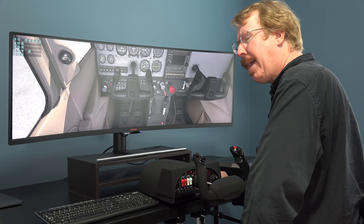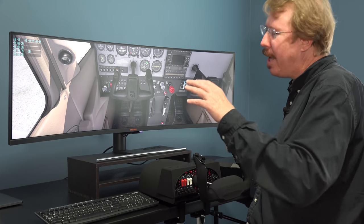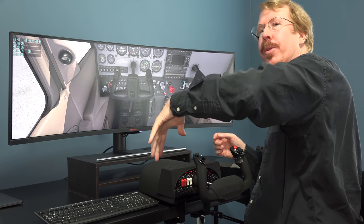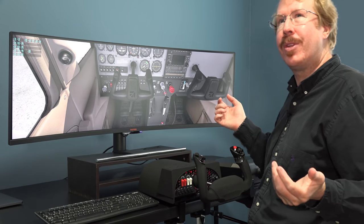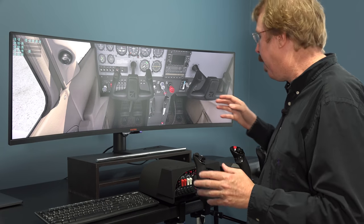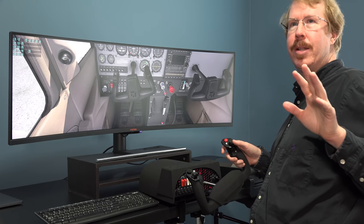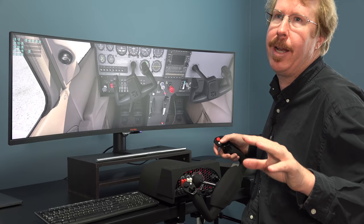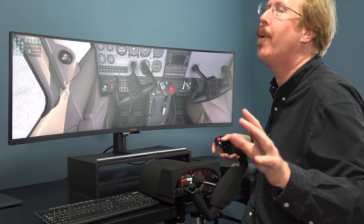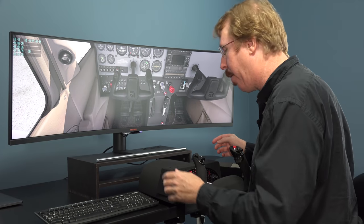The A and B trim both have to be pressed at the same time now to trim the plane. After some Googling, I can't find that real airplanes have this dual-switch safety system for roll trim very often. Remember, if a roll trim runs away, it's not the end of the world — you can usually overpower it. It's really only the pitch trim down that you need to be hyper paranoid about, because as the airplane goes nose-down, speed builds up so fast that aerodynamic forces rapidly exceed the pilot's ability to fly it. In comments we'll probably find the one guy who flew an SR-71 in 1965 with a dual roll trim, but for all the airplanes I've flown, it's only pitch where they're hyper paranoid about a runaway.